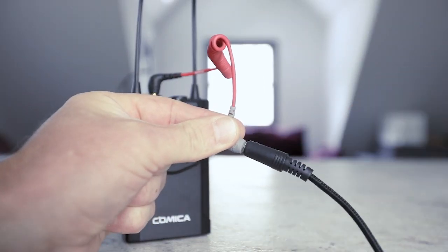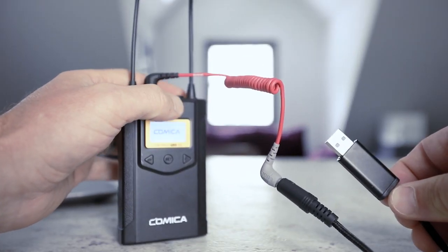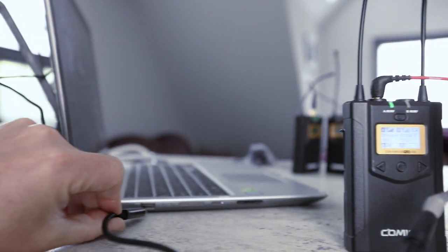So now we've got a 4-ring TRRS, but that still won't work if you plug it into the little port on the laptop. I was scratching my head wondering why it doesn't work. What we have to do is convert that signal into USB. So it requires another cable which converts this 4-ring TRRS into USB. So the full chain looks like this: from the receiver of the lapel mic, into the TRS to TRRS converter, which then goes into the TRRS to USB converter, and we plug that into the USB port.